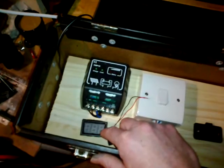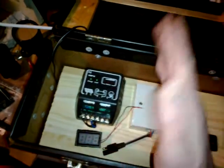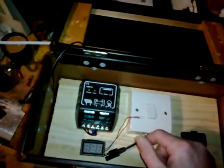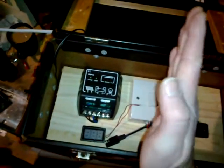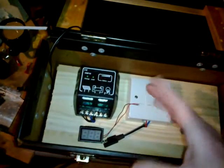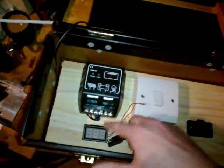The other one will tell me how much solar is coming in. It's all right pointing the solar panel at the sun — south or east for the morning — but it's nice to know you've got the angle for maximum output. So many times I've put the solar panel out and been getting 12 or 13 volts, then tilted it back and it's jumped up to 21 volts. For the sake of gaining 5 or 10 volts, it's definitely worth keeping an eye on how much power's actually coming in.